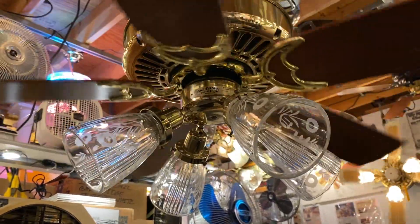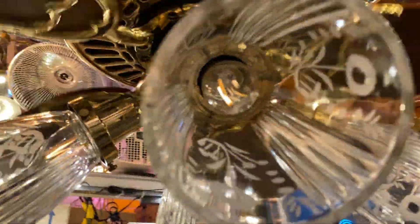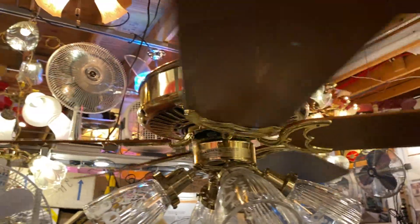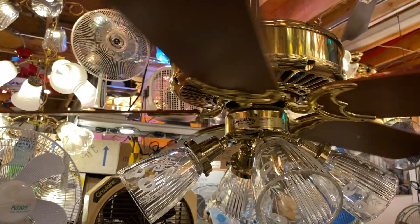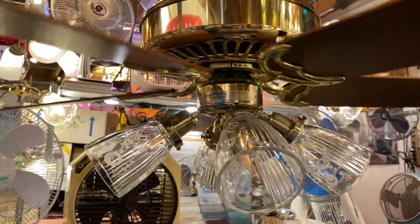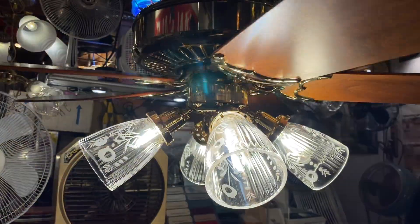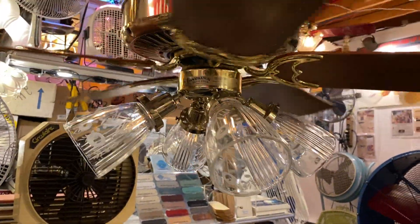I think what Philips needs to do is fine-tune their driver boards in these bulbs so that they're less sensitive to trickles of current — small amounts of current — so that these bulbs can shut completely off when used with older solid-state lighting controls such as IntelliTouch.